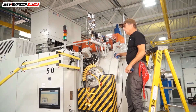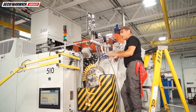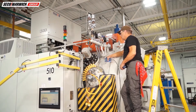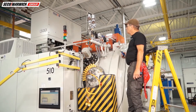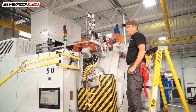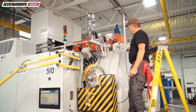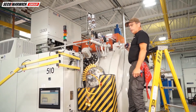It's all the more reason to check it because it's an actual moving seal. If the customer doesn't have a helium leak detector, I'll sometimes manually open and close the valve while pumping down — if I see a spike in the vacuum that can lead me toward that being the problem. Could you bubble-check a joint? You could go up to 10 bar pressure and try soapy bubbles, but that only works if you've got a very large leak. For the small leaks we're talking about, you really need the helium to detect it. I'll go ahead and hit the upper part of the door clamp to get helium in by the door seal and follow that around.